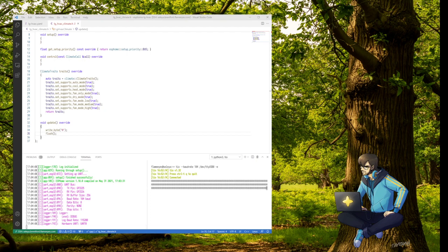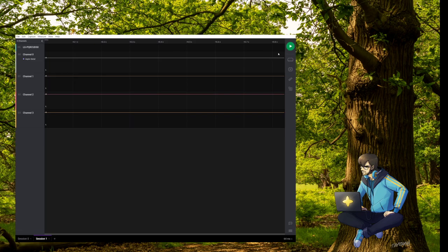Okay, it seems like the flush is working, so let me actually do that on camera. Very good. So this is slightly better, and you can see that this is actually sending 1 signal only at a time, but there are 2.5 seconds between, well, okay, let's call it between the first one. If I set this one as T0, the second one is happening 2.5 seconds later. So the polling doesn't quite work the way I want it to work, because it's just too slow.